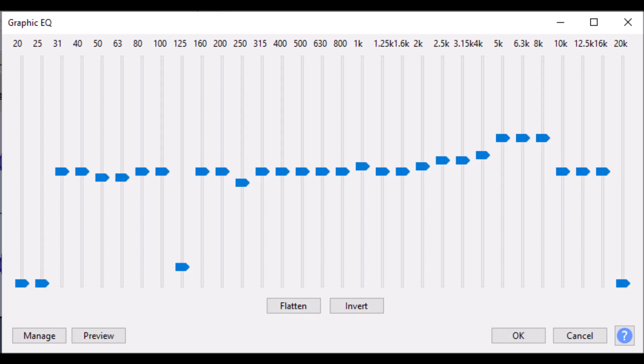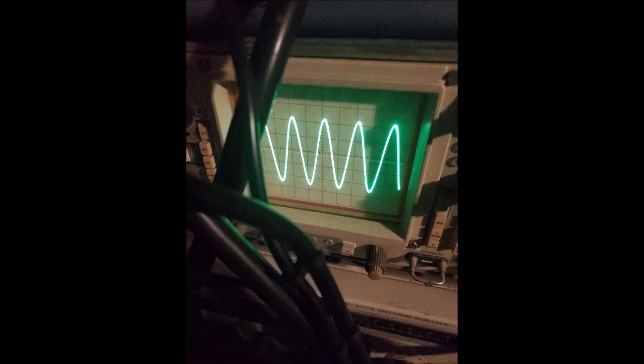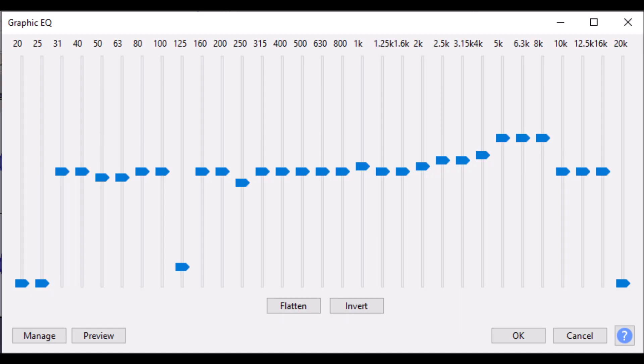As you just saw there, the duplicated copy suffers in the audio quality department. Worth mentioning: the duplicated tape has some slight damage, so you can hear a dropout in the left channel. Also, I had to rebuild this duplicator when I got it — I had to do mechanical and electrical alignments, and align the head with regards to azimuth, because that was totally off, likely because the head rests on a plastic shim that got messed up in shipping. I also had to recap the amplifier. Now, in this picture, this is the EQ curve I apply via Audacity. I'll play the EQ'd master and then the EQ'd duplicate — the goal is for the EQ'd duplicate to sound as close as possible to the original master before EQing, recovering the high-frequency components that are lost.